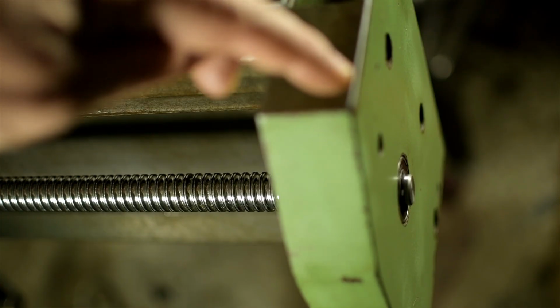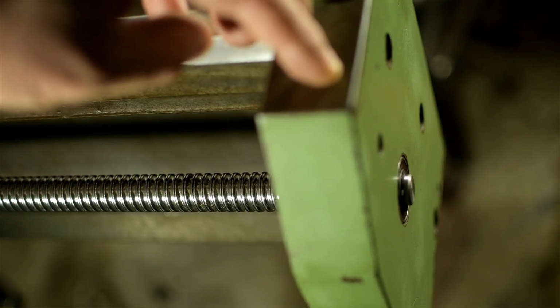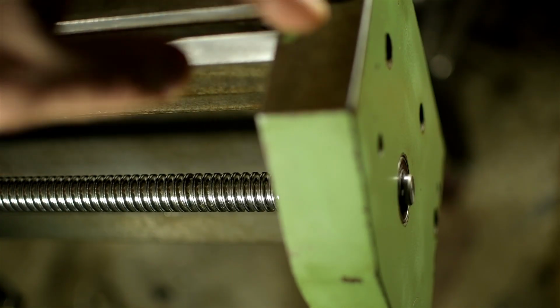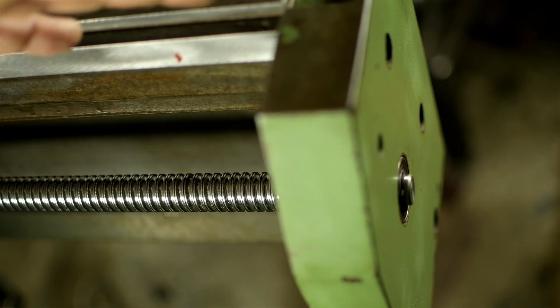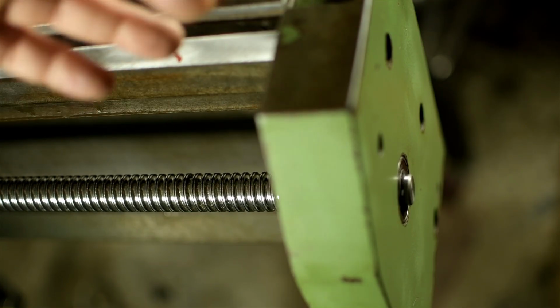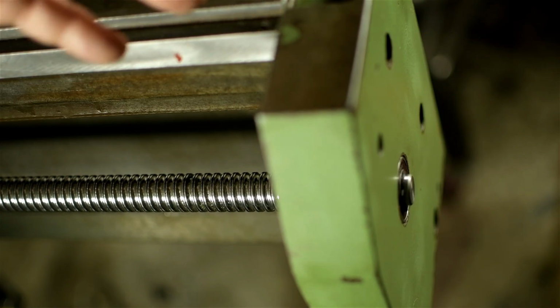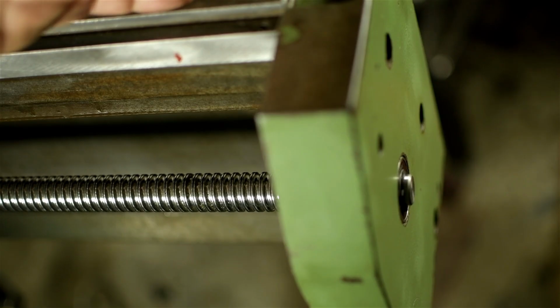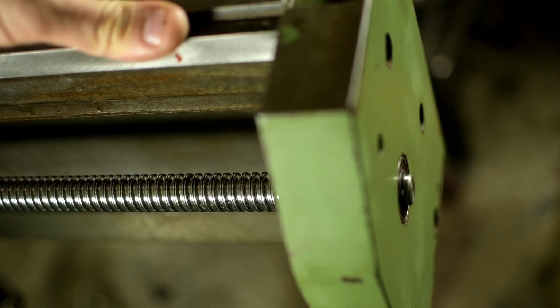That's just a precision through bore. Like the OD of that bearing would just slide back and forth in this end cap. That keeps the screw centered, keeps it from whipping around, but doesn't over-constrain it, which is fortunate because the rapids on this machine now are going to be so fast. That will help mitigate some of the relativistic effects when the length contraction starts to take effect. Nonetheless, I would have preferred if that were sub-flush and I could put a nice plastic cap in the end.